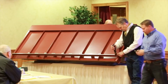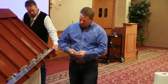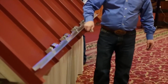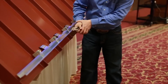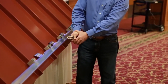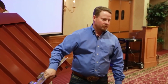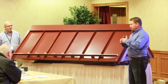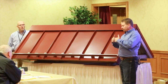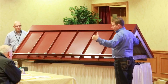The next thing you're gonna do is set up a pair of vice grips pretty tight, and you'll come in 1 per color strip. You grab the lip of the bar of the ColorGard, you squeeze and turn down. And what that does is it gives you a nice little divot in there to keep the color strip from moving. That prevents it, especially where you've got it lapped, from moving too much because it could work itself loose and keep going.